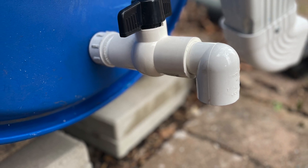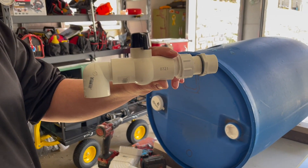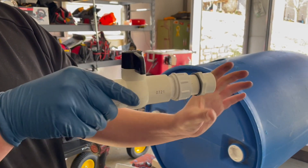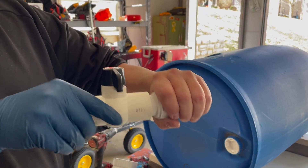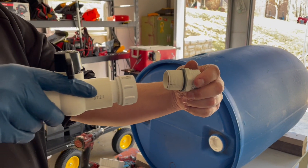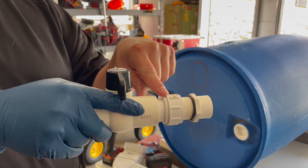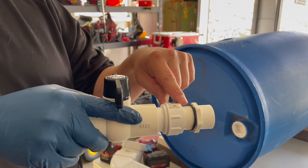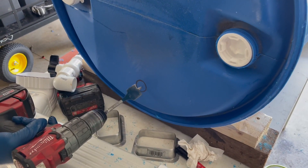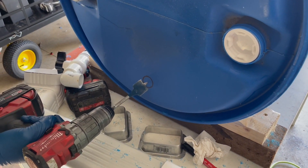The next thing we're going to want to do is put in that spigot. I went ahead and got some PVC fittings that can go through the wall of the pipe. This little corner elbow is going to come out to where I can also add a part that hooks up to a garden hose. I've got a threaded fitting and I bought O-rings — these are number 18 O-rings for what I believe is a 1-inch threaded fitting. The inside diameter is so small that if you end up with enough built-up sediment in the bottom of this rain barrel, you could eventually clog that up. Why restrict the flow?